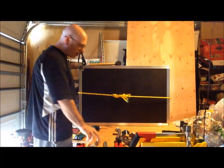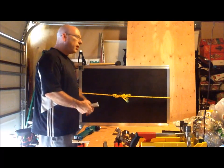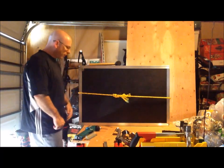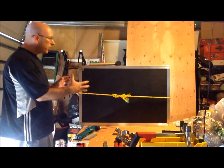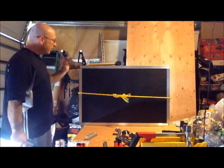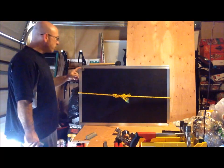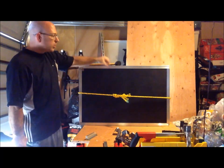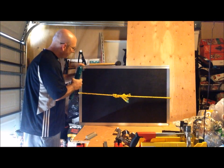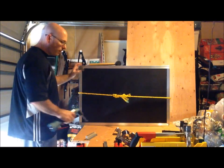I'm going to quickly put together one corner. I have it roped together — as you go, you're going to have pieces of a puzzle with all your angle brackets and your laminated wood. You have to put your laminated wood together like a puzzle and strap it together. I'm just using plastic rope to make it tight, get everything seated, and then start putting on the bracket. This corner bracket is not going through your aluminum, so it's still going to require rivets.